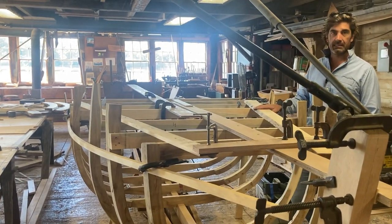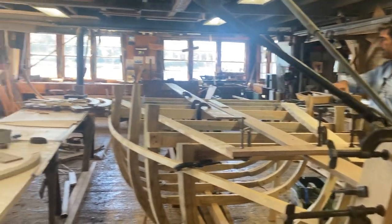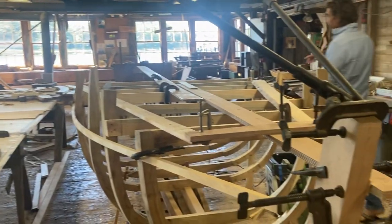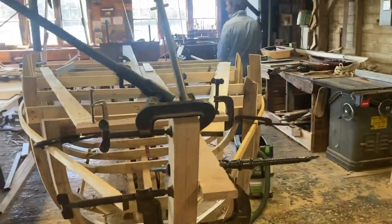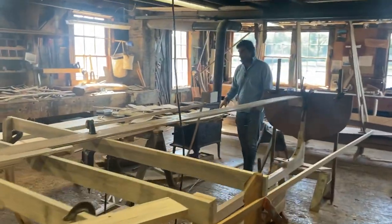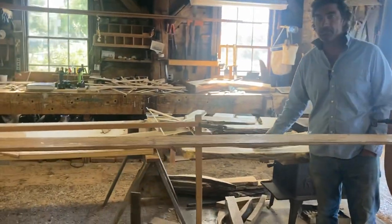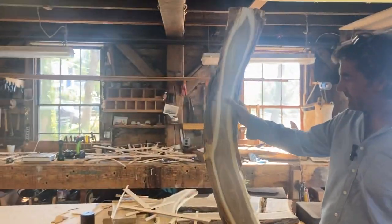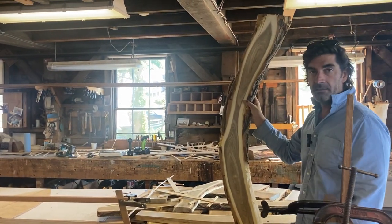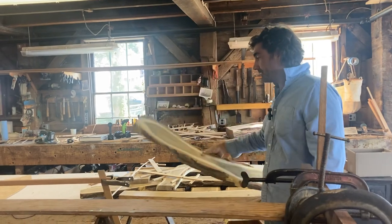It's a replica of a boat that he has that was recorded. We've lofted it. We're in the process of framing it, getting the backbone structure out and getting it framed. For those of you watching — if you go out in your backyard and you have any locust trees that might be down, please get in touch. We are trying to frame this entirely in locust, and we're looking for pieces like this — not terribly big, but pieces that have a nice curve to them. We can actually utilize pretty small branch-type pieces.